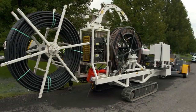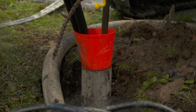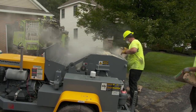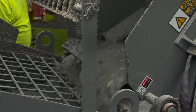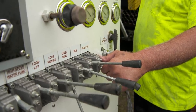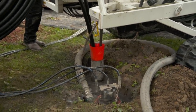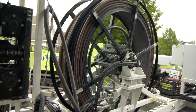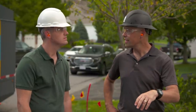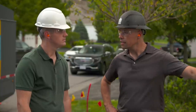I can see the loop rig coming in — I see the high-density polyethylene pipe being lowered into the borehole, and I also see another pipe coming in at the same time. What's that pipe for? That is the coil tubing pipe, and that's going to enable us to grout from the bottom up, which is an underwater grouting technique. That will create a column with really good contact with the earth for good efficiency. This grouting layer has two purposes: the first is to conduct heat from the soil to the ground loop, and the second is to ensure that no pollution or impurities can penetrate the soil toward the aquifers. Now we have completed our drilling, looping, and grouting — the geothermal loop has been installed, and this will be linked to the inside of the house.